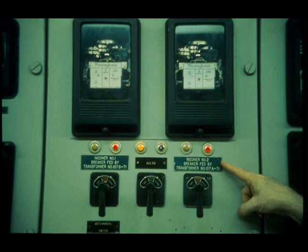When a short circuit or other condition has blown a fuse, first correct the condition, then replace the fuse. When a short circuit or other condition has opened a circuit breaker, the condition should be corrected first, then the circuit breaker must be reset.